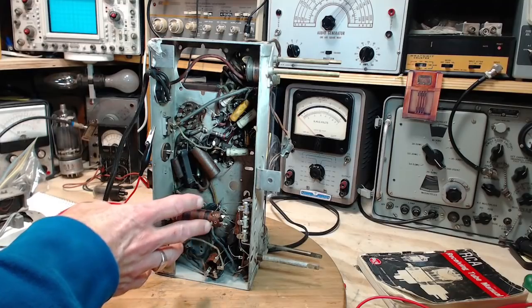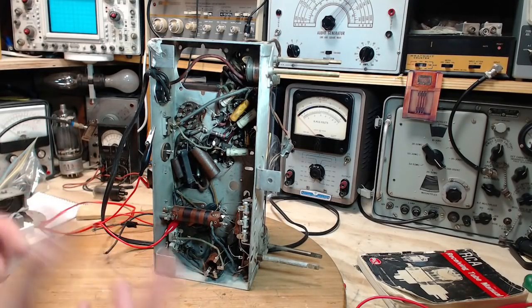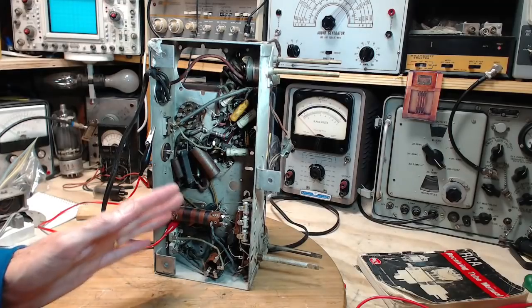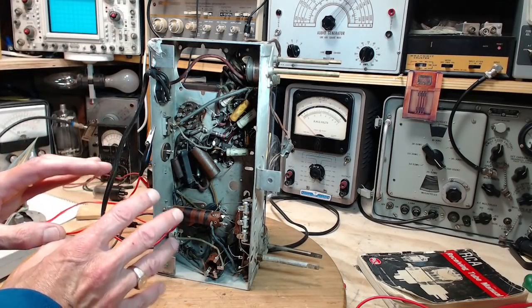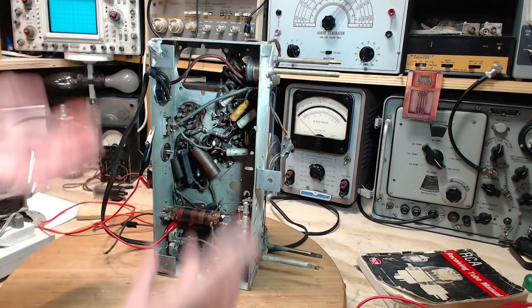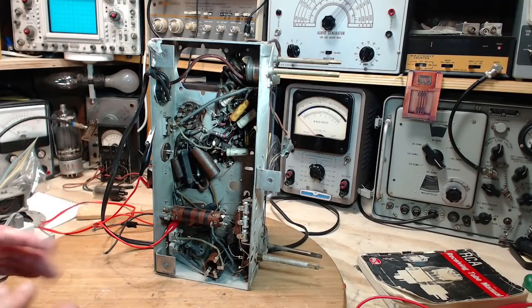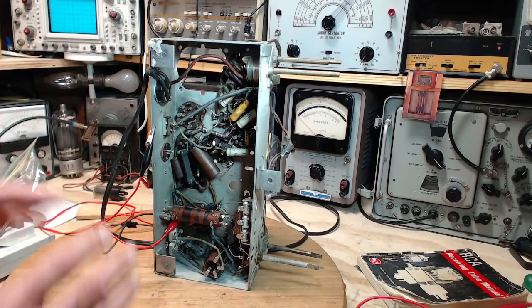You know, four tubes we're going to power up. They're all in parallel. Each one's going to draw about a quarter of an amp, maybe a third of an amp. You put the four together, we're going to pull about an amp into here. The problem I have now is if I set this up wrong, how do I know, number one, before I end up doing something bad? Now, nothing too bad should happen. It's just 6 volts on the end of this wire. It's not a lot. But I just like to be a little more certain.